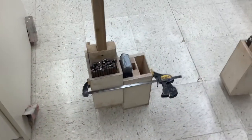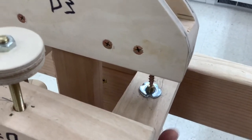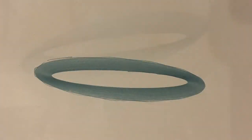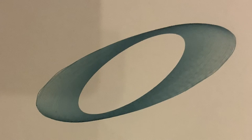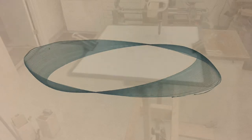To show the effect of small period changes, I immobilized the pen pendulum so it didn't move. Then I spent about a half an hour adjusting the paper pendulum's y-axis period so it was essentially the same as the x period. Eventually I was able to get this drawing of an elliptical shape. The major axis of the ellipse did not rotate as the motion decayed and the closely spaced lines don't overlap. I changed the y-axis pivots by about a quarter inch to get this next drawing. The ellipse axis rotated significantly but the lines do not cross. I changed the x-axis pivots by another quarter inch to get this drawing. Now the ellipse axis rotated more rapidly so that the lines crossed and the drawing began to look folded.